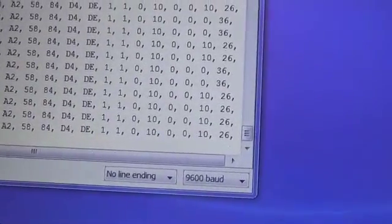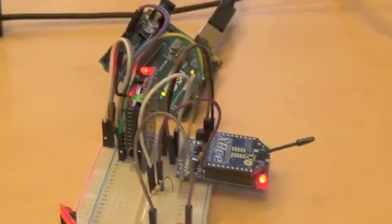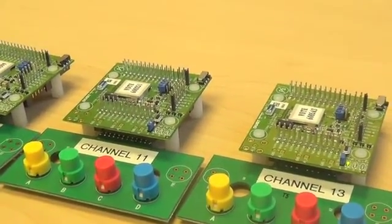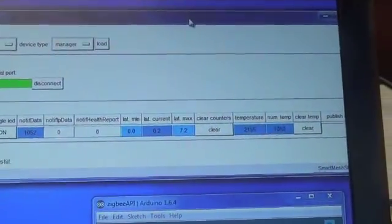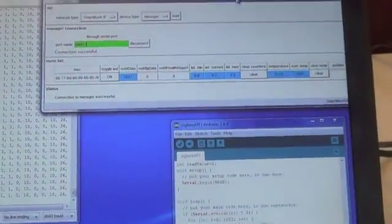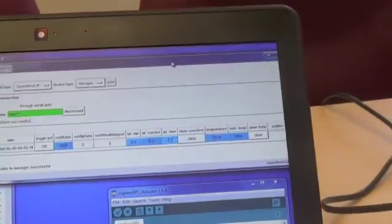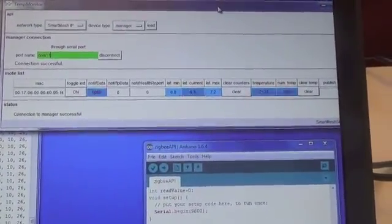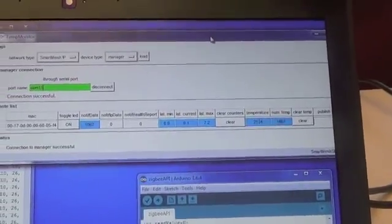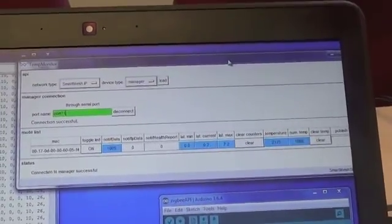And so that shows what we were trying to demonstrate, that a Zigbee network operating on a single channel can be completely destroyed by a single radio interferer. And even if you turn on multiple radio interferers, a SmartMesh IP network can work around it. So for high reliability data applications where you can't afford to have a single interferer cause the loss of your data, a SmartMesh IP network is substantially more robust.